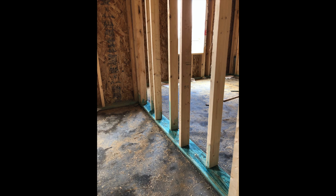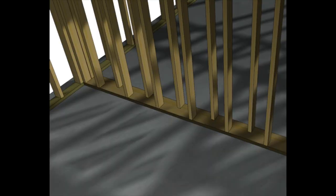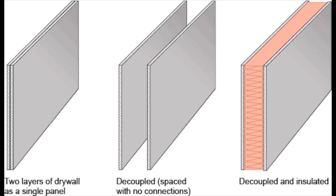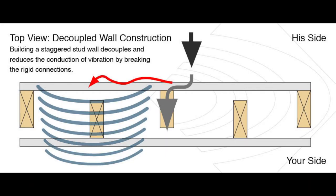The goal of this process is that there will be an added air cavity that helps with isolating sound. The air cavity will help absorb the sound coming through the wall, and although it might not seem like much, it does make a huge impact. It might make sense in theory to go with single studs that are six inches wide instead of a staggered stud construction. However, this will provide an air cavity that is not big enough to take advantage of — a person won't experience decoupling. The bigger the air cavity is, the more of an impact it makes on soundproofing.